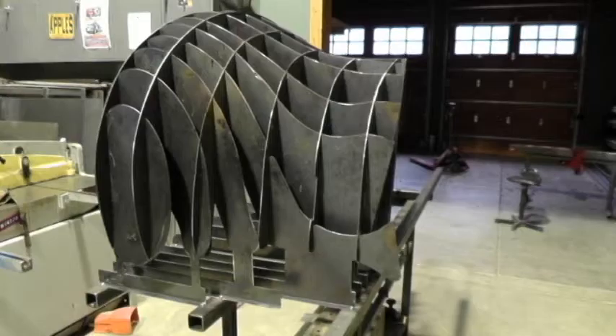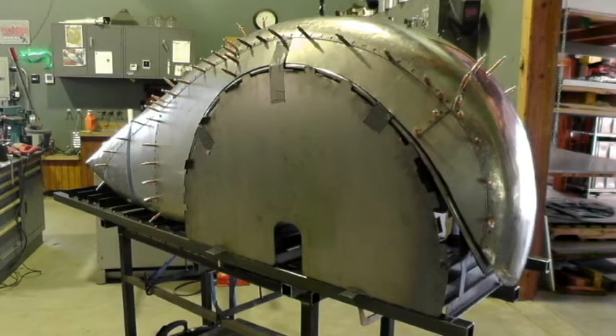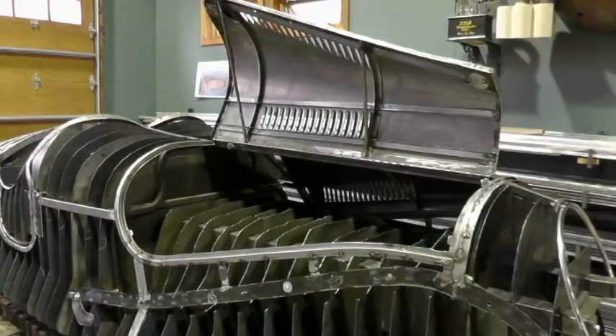After the design phase, the buck is part of the program. I cut this out on a CNC plasma cutter and it provides you the geometry to shape the sheet metal. It's virtually impossible to build a body without a buck. The body is trimmed on all the edges and all the joints, which helps you define a good fit between panels.